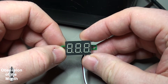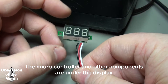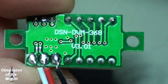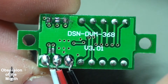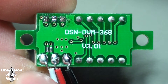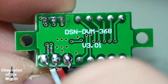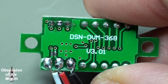So it's just a three-digit seven-segment display with little dots here. It uses three wires, although it can be configured for only two. On the back here — power comes in on the red and black, and the white is the sensing wire. You can either connect the white and the red wire together, or there's a little trace here — you can just bridge this solder connection.